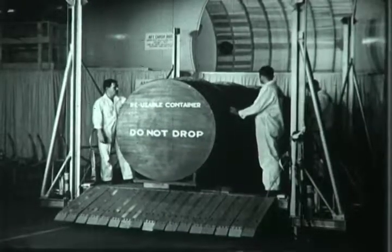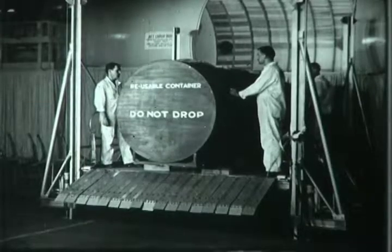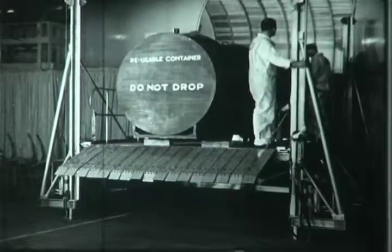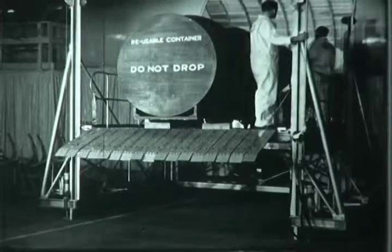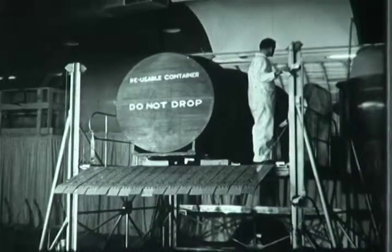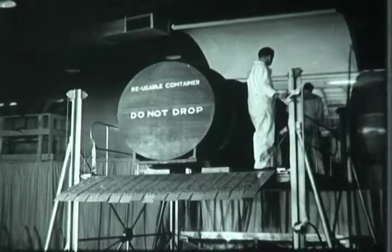above ground level. The elevator consists of four vertical stanchions upon which a level platform moves up or down. It does not depend upon the airplane for support, may be moved about on its own set of rubber-tired wheels, and may be easily dismantled and carried in the lower cargo compartments of the new Constellation. The elevator's outboard ramp consists of serrated sections which adapt themselves to irregularities on the ground surface.